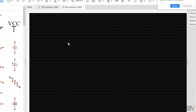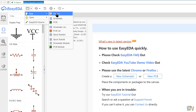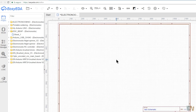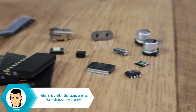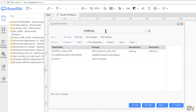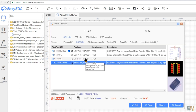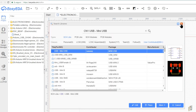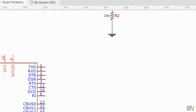I've used EasyEDA to create my schematic and layout. Go to EasyEDA, create a new project, and give it a name — this will open a new schematic sheet. Before you start, you should have a list of all the components you need. Go to libraries and search for the selected components. I first add the ATmega 328 DIP version, place the FT232 communication chip, the voltage regulator, the USB connector, and the pin connectors. I have the I/O pins twice since I want two lines of pins.